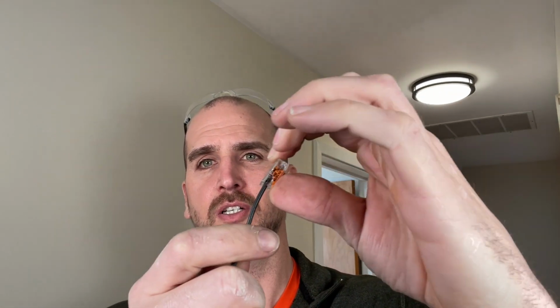So what this is, I'll take the solid core wire and place it in and then just close that lever. You can then see that the wire is fully seated within the housing because it's transparent, and also it passes the pull test. Now you can also take a braided strand and similarly pass it through to the end of travel, hit the lever, and now this is equivalent to your wire nut.